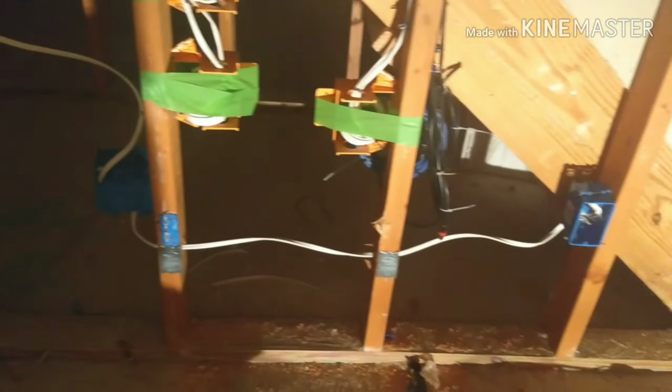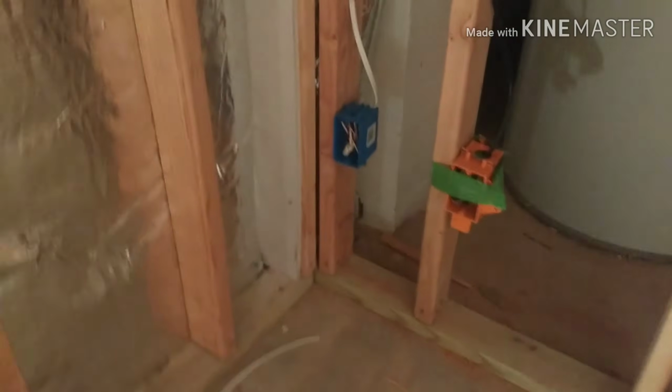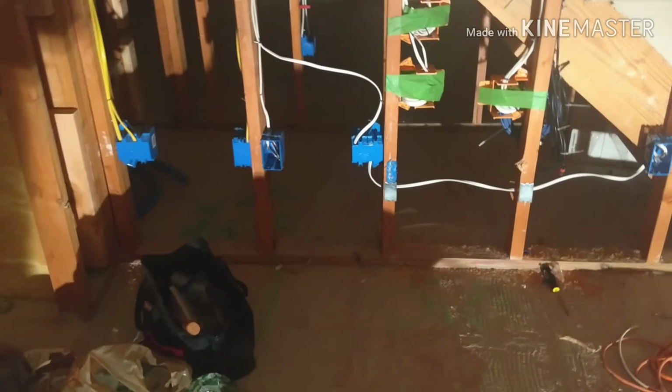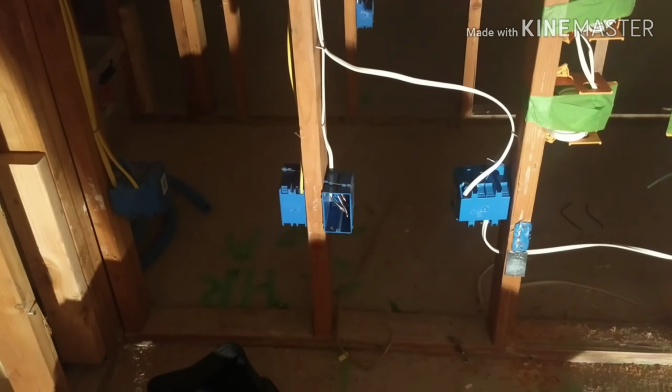So basically all that I'm doing is creating a power bridge. And the same thing, if you see the other white wire that goes up, it basically goes up and comes to the back here and goes to the other outlet here, which is my second subwoofer, the day when I decide to buy one. So that's going to be the same, where it's going to be powered from the 20 amp dedicated line using a power inlet connection. So that's my electrical outlets and electrical design that we're doing for this room.